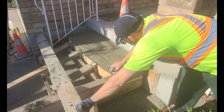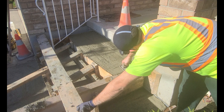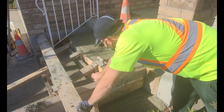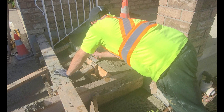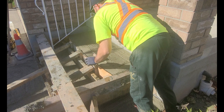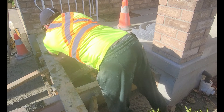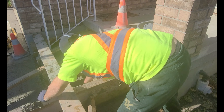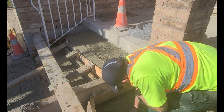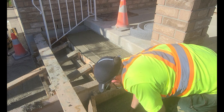I'm now going to be using a brass edger to put in my second pass along the front steps. Keeping the edges open is a very important part of the concrete finishing, as the concrete can take off at any time. And when it does take off, these edges will be prepped for the final edge. The additional paste really comes in handy at this point.